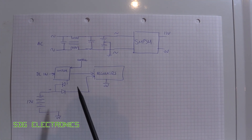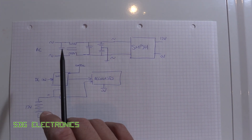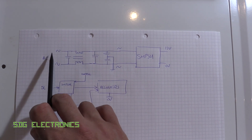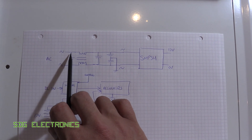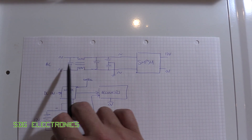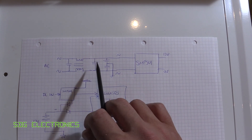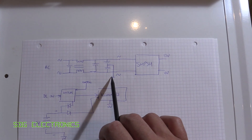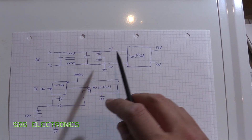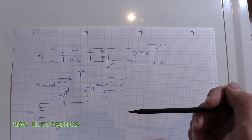One suggestion is installing the device on its own circuit, which gets around some problems although you may still get some noise on the supply wires. The other recommendation is installing an EMI filter. Most of them have a circuit with capacitances across the AC waveform, a common mode choke to stop common mode noise getting into the switch mode power supply, and capacitors conducting noise back down to mains earth. By the time it reaches the switch mode power supply, the majority of the noise will be dissipated, depending on your EMI filter selection.